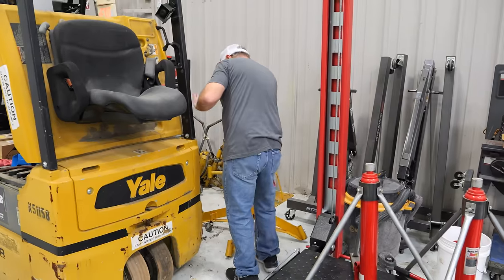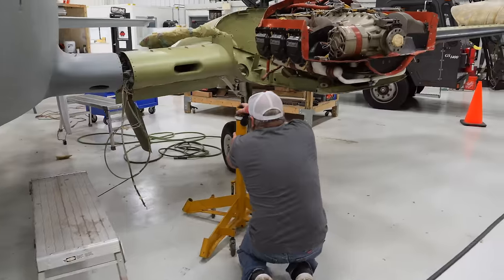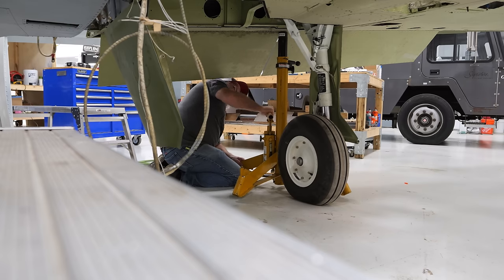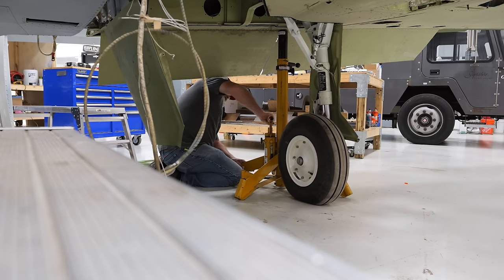So it's just like a push pull on the cable on both sides going into a spring, onto a bell crank, and that's what gives you your articulating steering in the front, and it works in unison with the rudder. And those springs, like I had mentioned earlier, have some give, so if you hit something, the spring springs and you don't snap a cable. That's good.